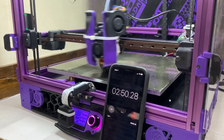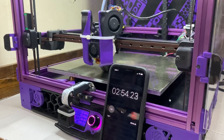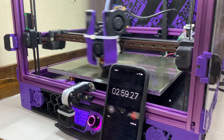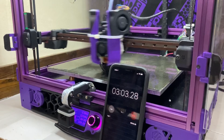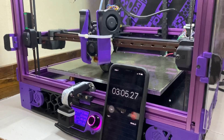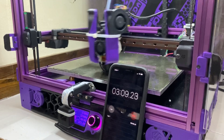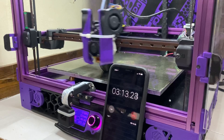I am probably pushing the extrusion limit. I'm requesting over 50 millimeters cubed per second while printing. Some of that's already liquid moving through the hot end while the travels are happening, so I'm not requesting that full time. But yes, it's a lot of extrusion, and this hot end is not rated for that much extrusion at all.